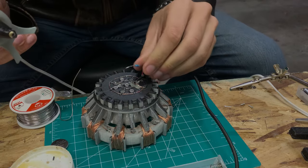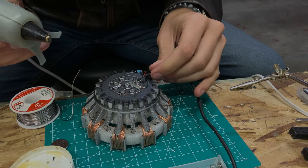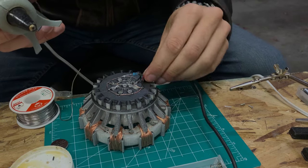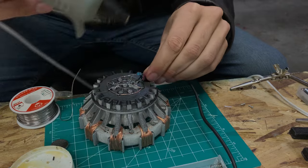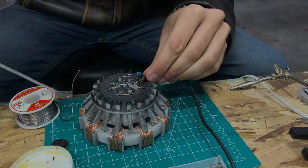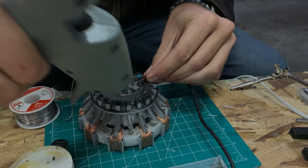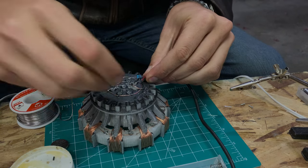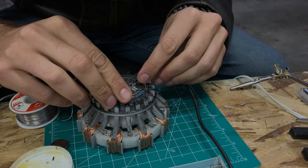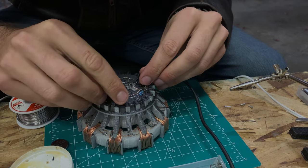And then it was pretty easy at that point. I just soldered the positive and negative ends of the USB to the circuit. The positive before the resistors and the negative to just any negative point in the circuit. A dab of hot glue was put down anywhere there was even the possibility of a short circuit. And it was also used to secure the switch in place. That means under the crystal ring where the copper wire gets wound, and the overlapping of the bare copper wire when we were connecting the crystals together.